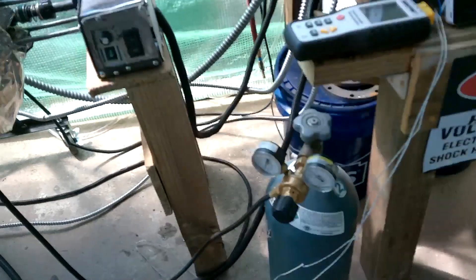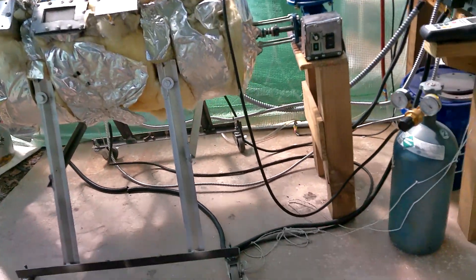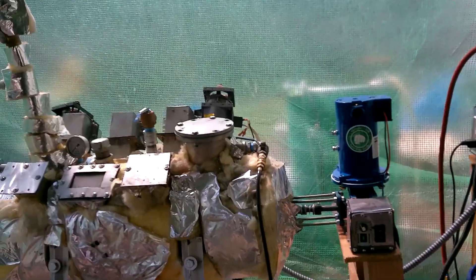We have this argon going for a little bit. There's some pressure building up — let's do the little flame check I do. It should not be lasting like that, it should be going out. You see it's actually a little bit flammable, so I'm glad we do this argon check because clearly there's still some flammable vapors from the last run. We need to make sure all the air is out for safety. After some time, the flame can't even light — it gets quenched in the argon environment. Airtightness check. It probably started with a lot of air pockets individually because styrofoam is so porous and has so much air in it to begin with — it really took a lot of time to get all that air out.